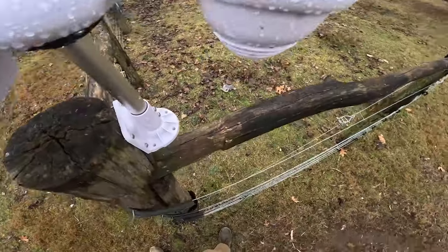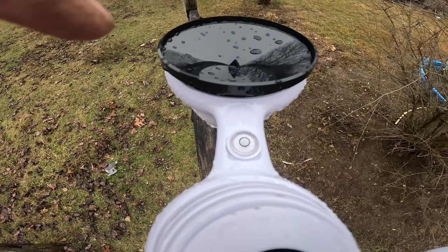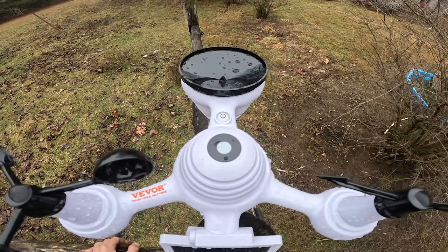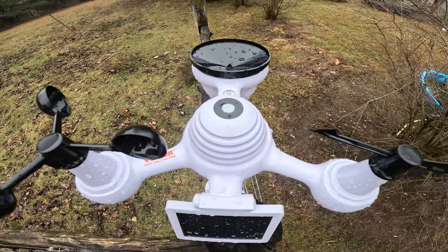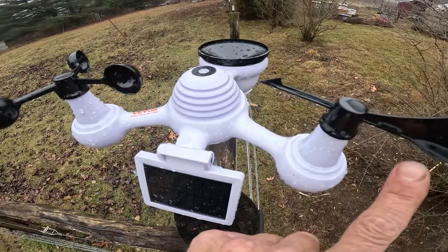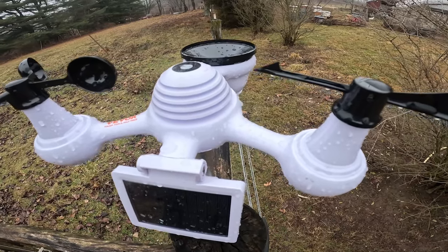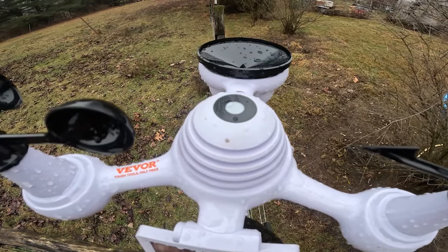Looking right here, there is an indicator — this arm needs to point north. The better job you do of pointing it north, the better this is going to read from the inside as far as which direction your wind is coming from. If this isn't accurate, the wind direction reading isn't going to be accurate either. So take your time and set it up as it should be.